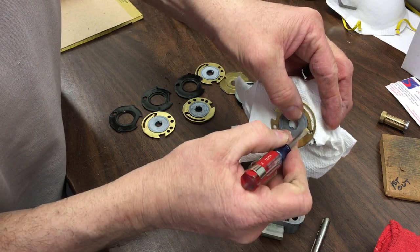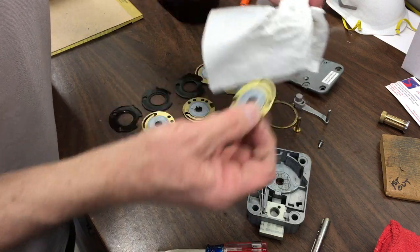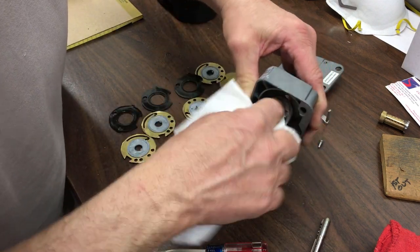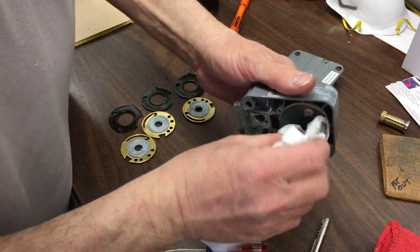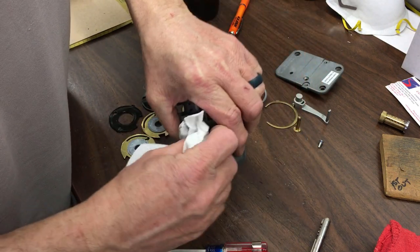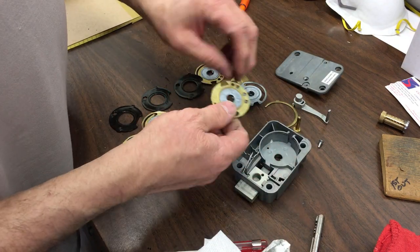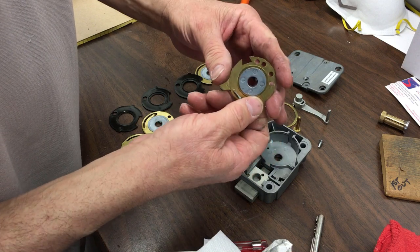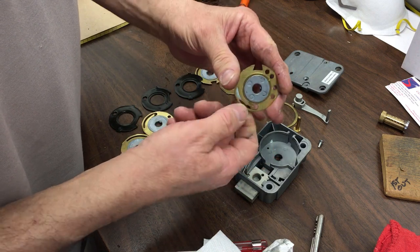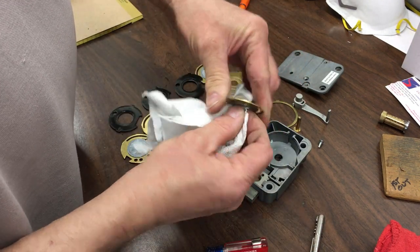You can see the dirt inside here. What happens when you stick a key that's been in your dirty pocket into your clean lock after you lubricate it — that makes it even worse. That's terrible. Never lubricate a safe lock — there are exceptions but not very many. Never lubricate a safe lock. For those of you unaware, brass is considered a self-lubricating metal. If you add oil or grease to these, they will collect dirt fast and make things bad — so don't do it.